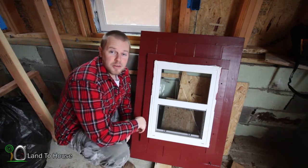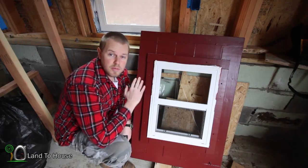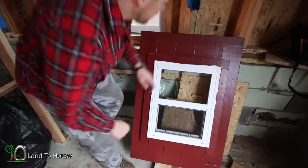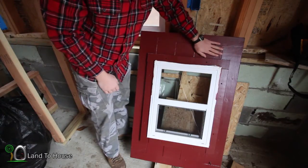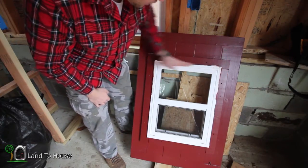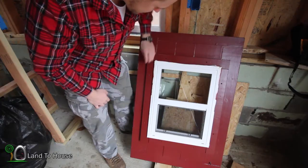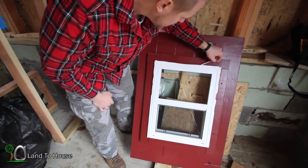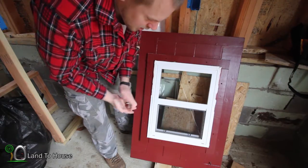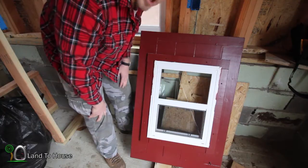I have to apologize for all the critical steps I've missed in this build — it's taken me roughly three weeks to get this front door built. Let me walk through what I did: I put primer and paint on the main door. Then I took these two by six strips, cut them in half, and ripped them into slivers — cut those twice and got them painted and put on. I got masking tape around here. The latch is on, the hinges are on. Now it's just time to install this thing.